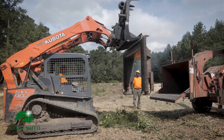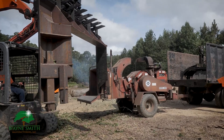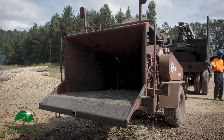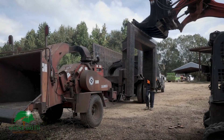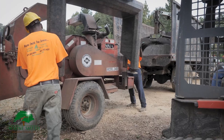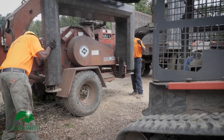Notice this alters the chipper in no way. You have a mechanical-fed chipper and a hand-fed chipper all in one — this just converts a hand-fed chipper to a mechanically fed chipper. It takes a little practice, but once you do it, it's only a matter of minutes to put it on and off. This gives you the ability to hand feed when need arises, or if you have a large job with a lot of material to chip, you simply put the chipper feed adapter on and you're mechanically fed from there on.